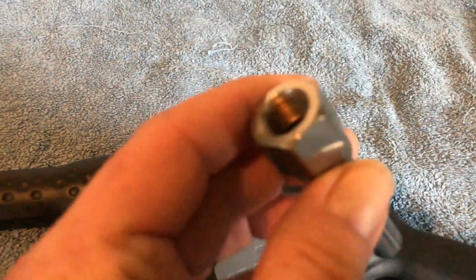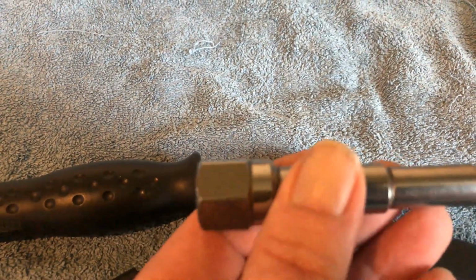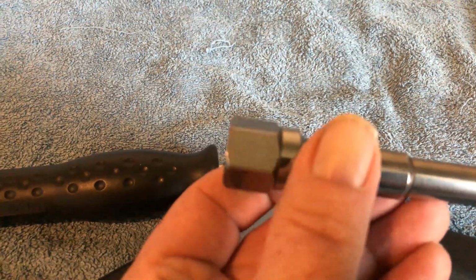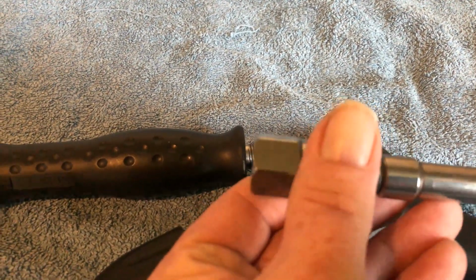You've got to be very careful with these. If you put one of these spigots that's full thread onto a lance that's steel with a tapered thread, and you tape it, after a period of time you'll get a hairline crack right the way up it. Always glue, and don't over tighten onto a tapered thread lance.